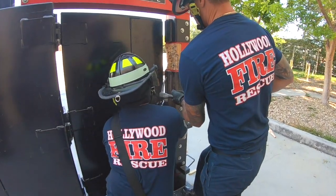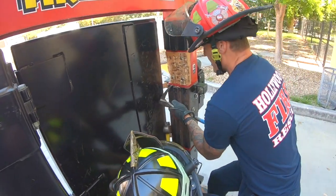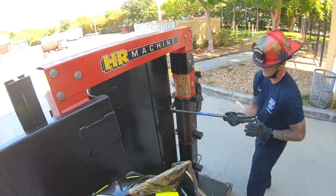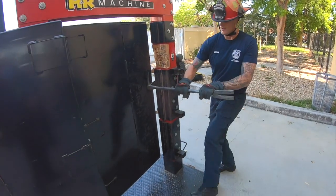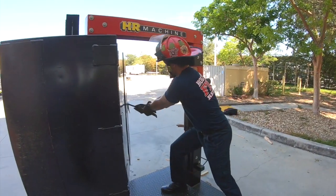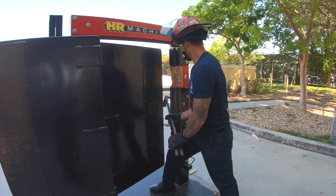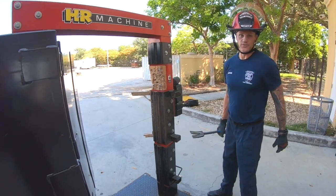Now you can slide to where it's holding. You can either rock down, or use the adze end here to finish it off. Reach in and control the door. That's your inward swinging door.